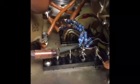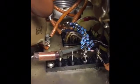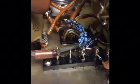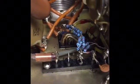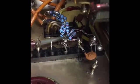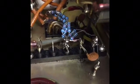Here's the repair — look at all those resistors. I basically built a bank of resistors to get my 10k at about two watts, and then I have a resistor bank of 1k at about half a watt, which should work fine. I've also got that germanium diode put in. We're going to test this and see what it does.